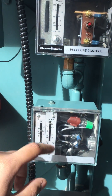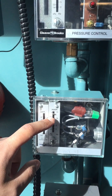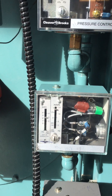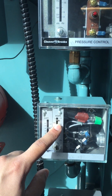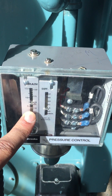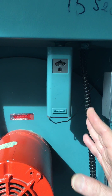This here is for control, essentially only on automatic. At 14 pounds, if it drops below 14 pounds — once it hits 14 pounds — it cuts the fire off. That four is the differential, so once it's dropped below 10 the fire comes back on at low. If it goes below seven, it calls for high fire.